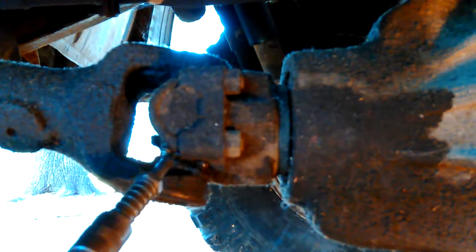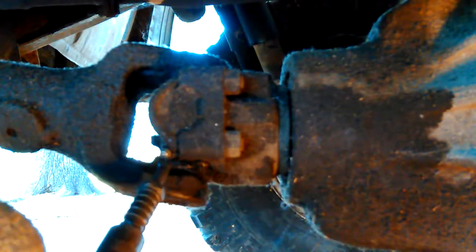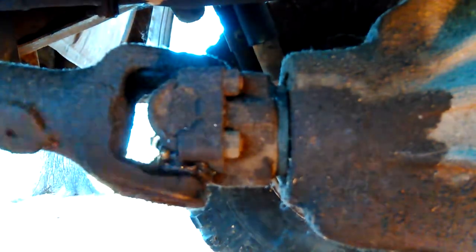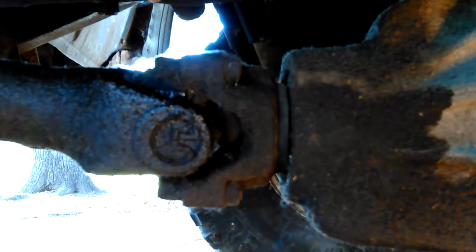You can usually just poke the little ball bearing there and squeeze some grease in that way. Sometimes I've had to do that because I couldn't get the coupler on there. I can get it on the front end of this one. I'll make sure it comes out of both sides before I quit. This time I won't have to overdo it because I can actually see what I'm doing. I know I overdid it on the other end. So that one's done.